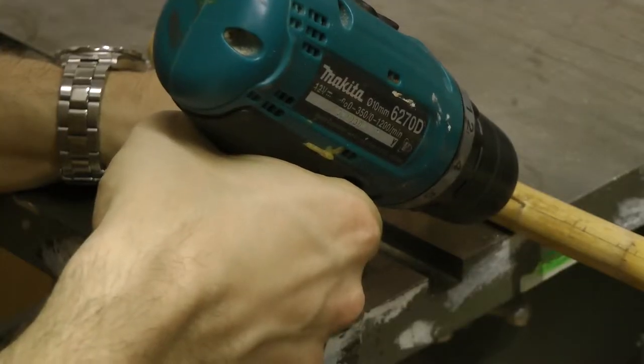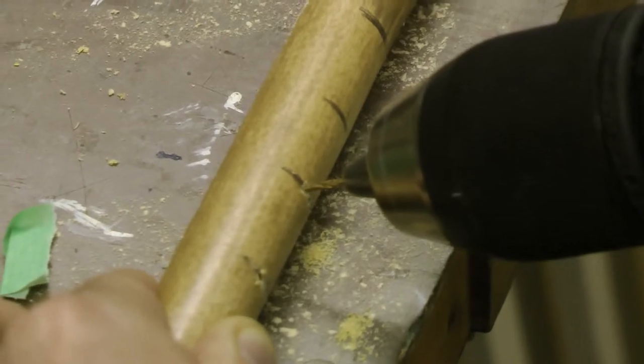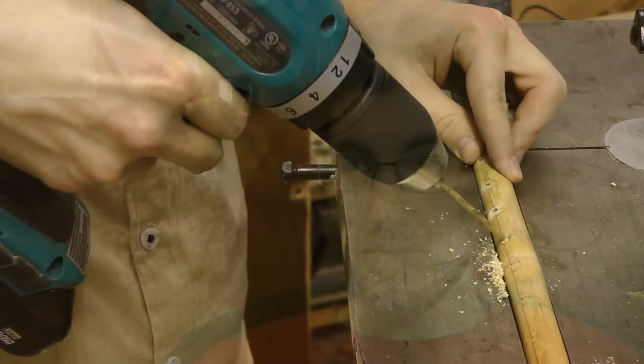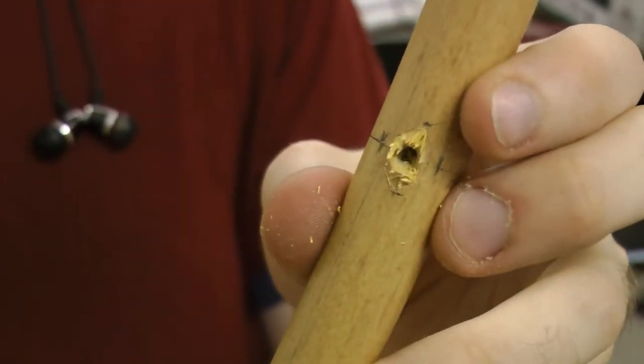Then with an electric drill, we used a very small bit to drill the first hole at the very center of each point. Using a small bit is really helpful because it gives you guidance as to where you're going in. When we started moving up to larger sized bits — around five millimeters wide — it actually started to tear up the outsides of the hole and it wasn't very attractive. So using too large a drill bit didn't seem effective, and perhaps a different style of bit would have been preferable.